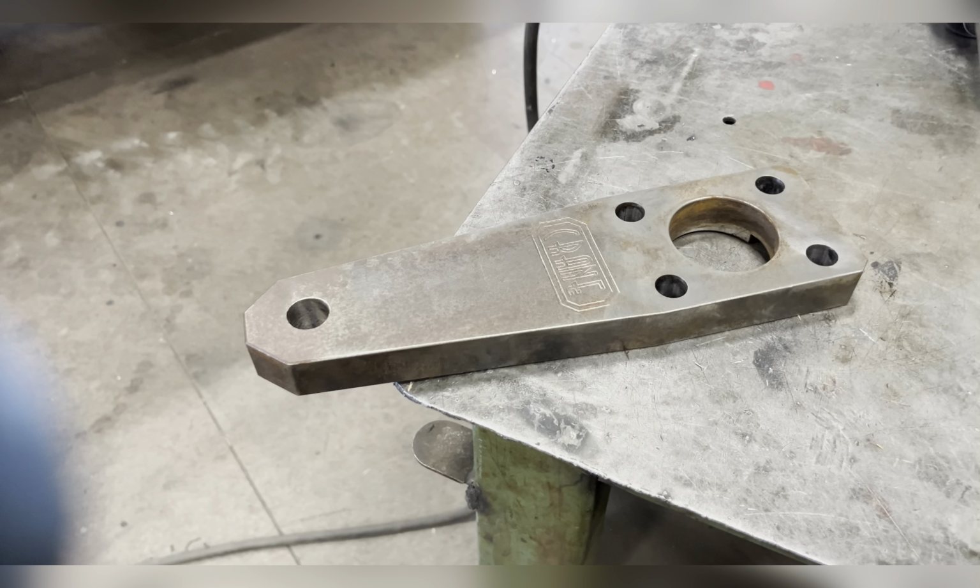And the same thing on the rear. Center it with the axle, set your toe, figure out how long each of your links need to be, cut them, weld them, paint them, install. Done.